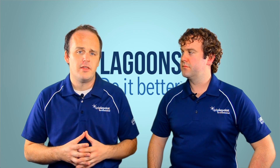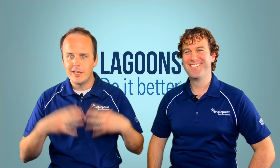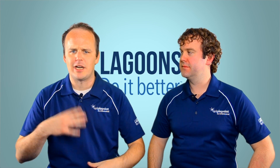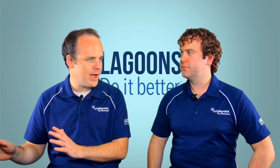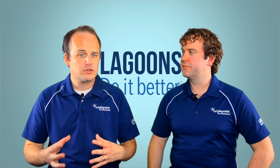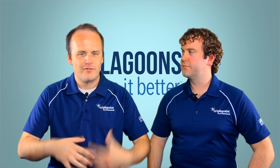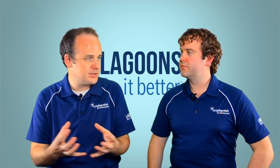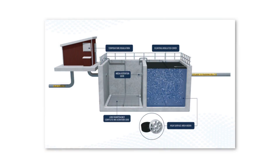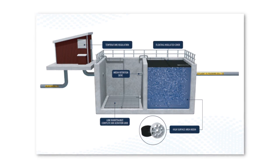The two-stage nitrification process uses two concrete tanks. First, they have coarse bubble aeration grids on the bottom — essentially a pipe with holes in it, a simple technology that transfers oxygen to water while keeping things highly mixed. There's no opportunity for anything to settle out because of the turbulence. We also have attached growth surface area modules — little media pieces like Chex Mix that float and tumble around. Nitrifiers grow on the inner protected surface area of these pieces. Because we can fit so much surface area in these small tanks, we get very rapid nitrification and grow a high nitrifying biomass.